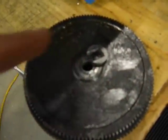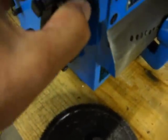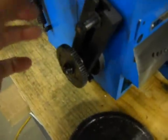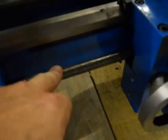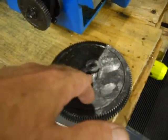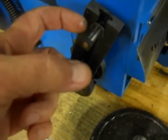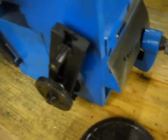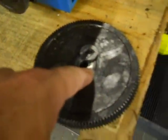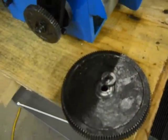There's a bearing inside here or a bushing — it looks like it's cracked. You can't really see it, but we try to show it in the photos. What you do is you put this gear on here and then push this back up into position, and it catches these gears — that's what turns your feed screw. At the present time it's not operational because this is seizing up. There's a screw assembly and a stud that fits inside that bushing, but it's really, really tight and it really won't spin at all.